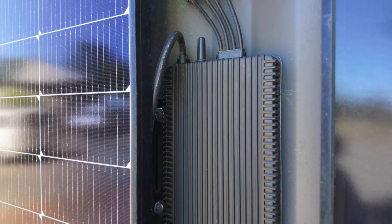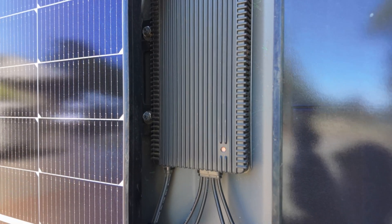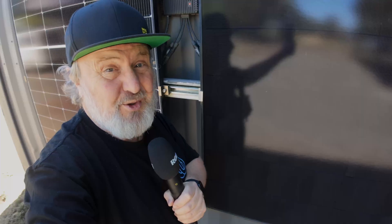One of the great things about microinverters is that they have individual MPPTs, and in this unit there's actually four. That means I can have four panels connected to one microinverter. This unit here is a 2000 VA — that's like 2000 watts in something the size of a laptop. Hoymiles make really compact, really efficient, and really durable microinverters.